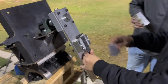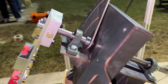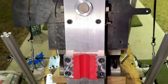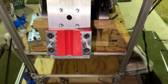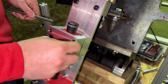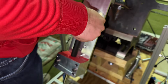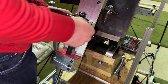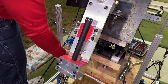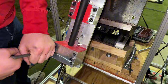The swing arm attaches directly to the axle and can rotate freely with 360 degrees of motion. It is locked into position using a pin and locking collar to keep it in place near the end of the arm. The grip holders have been fastened to the end of the arm to mimic the uppermost and lowest positions of contact in a person's grip of the club. These grip holders secure the club using specially molded silicone inserts, which provide a strong stable grip on the club while also dampening vibrations that occur during ball impact. This protects the arm and ensures that no unwanted forces affect the consistency of the machine or its data collection.